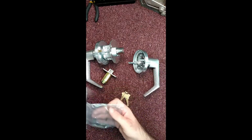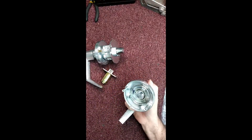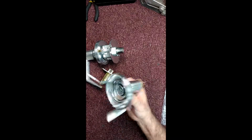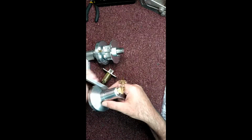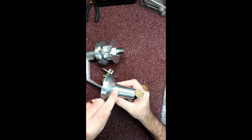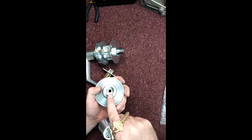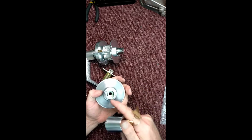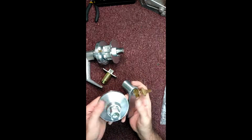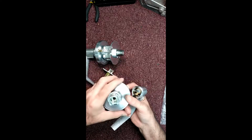If you need to ever take the cylinder out, it's very easy. Put your key in, turn it 90, depress a button, you know, standard operating procedure for different locks and things. The only difference is you can't get access to the retaining ring from the backside here. You actually do have to turn it 90 degrees here to allow you to depress the pin. Paperclip. So by doing that, it releases it. As you can see, there's that C clip I was talking about. So when that's vertical, that's butted up against right there, and that's what prevents the button from being pushed down. That's why you turn your key 90, so that tailpiece is horizontal, allowing this to depress. Anyways, so a little bit of knowledge there.